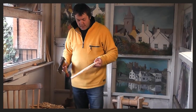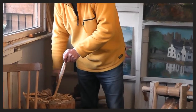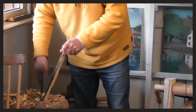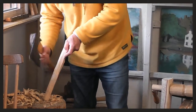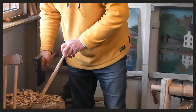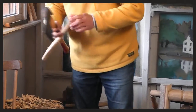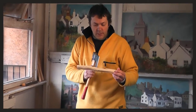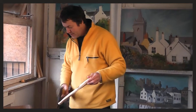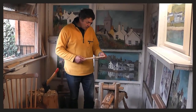I've got a side axe here and I'll show you what to do. This side axe is quite a dangerous tool and one of the golden rules is you only go to halfway up the piece of wood when you're working on it — otherwise it's extremely dangerous. The axe always stays on the wood and I never touch the wood with my other hand — that's another golden rule. So now we're going to go on and finish this off.